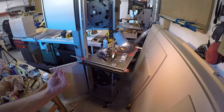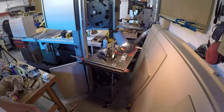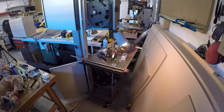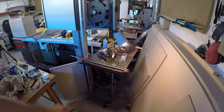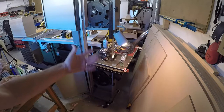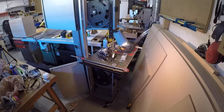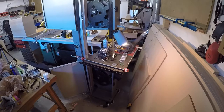I mean, one would think I could take the washer that I put in there and push it back so you're back to factory specs. It's just that adjustment bolt did something, so I think I need to see if I can adjust that. And again, I might have to take this guy and bring this one out after I fix this. Man, I don't know. I'm trying to figure out how to get it square without shimming the table, and I think maybe that might have to happen. It can't be. You can't have a factory Laguna made by Meber, whatever, have a blade or a table that's that out of whack. That doesn't make any sense.